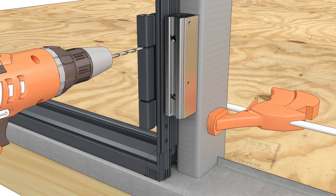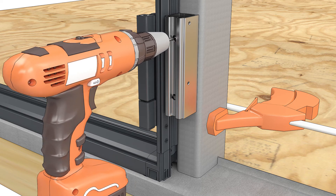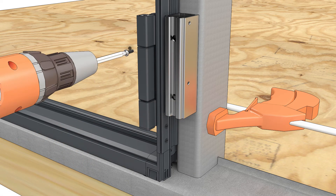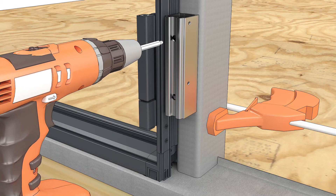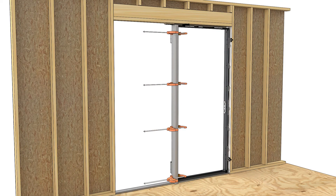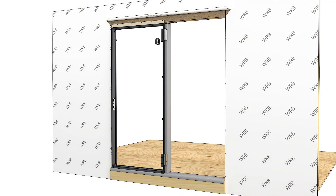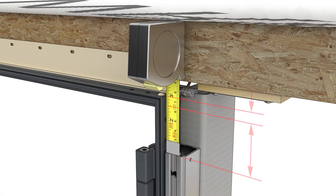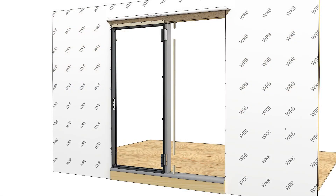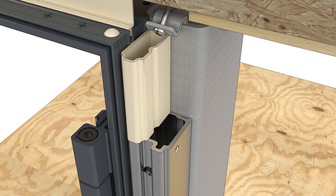On outswing doors, fasten the tube steel to the aluminum mull filler blocks. Pre-drill with a number 23 drill bit, then fasten the aluminum mull filler blocks to the tube steel with the screws provided. Remove the clamps. Measure and cut the vinyl mull filler to length to fit between the aluminum mull fillers within one-eighth of an inch. Additionally, cut blocks to fit at the top and the bottom of the aluminum mull fillers minus three-eighths of an inch. Temporarily install the fillers to make sure they fit properly.